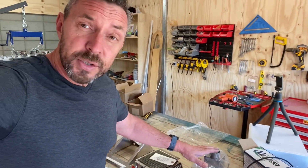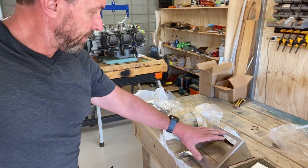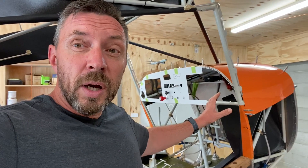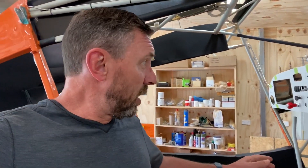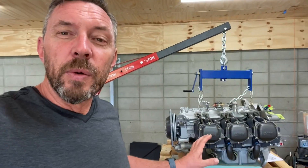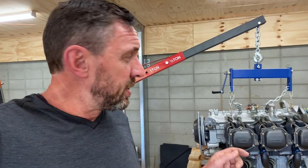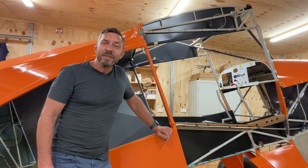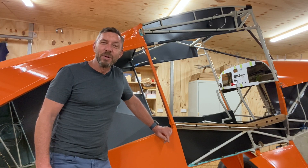The items I've got here for the engine include the two cabin air heat boxes, the oil cooler and its mounting bracket, the alternator to go on the engine itself, and the prop governor for the front of the engine. I'm planning to mount these temporarily in the next week or so just to get an idea of where everything fits. Over the next three to four weeks I'd like to finish the interior Kydex panelling and door panels, have the seats back from the upholsterer and installed, make progress with avionics wiring including fuel pump and lights, install the stick grips, and make and install the instrument panel. Forward of the firewall, my plan is to get underway with the engine installation — I'm thinking four to six weeks — and have the engine mounted with some ancillary devices installed. That's seven months of progress on the Bearhawk build. I'm still thoroughly enjoying it — thanks for watching, and I'll do another update in a month's time.